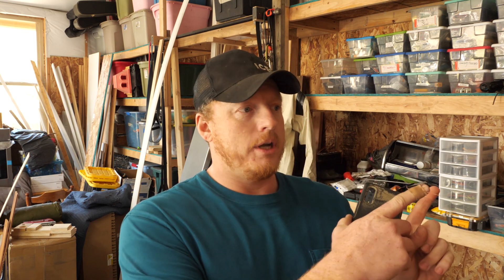Unfortunately, even with the beautiful app and Bluetooth that makes Victron so user-friendly, you just can't assign each profile to a different output — which I think is a downfall. Also, this is not the waterproof version; the waterproof version only goes up to 15 amps. This one is 30 amps, which I'm really enjoying. Even with the NOCO I could run both channels at 10 amps to get 20 amps total.